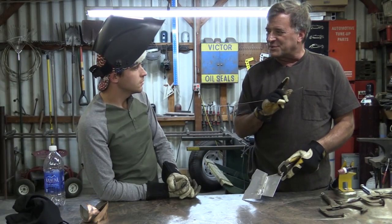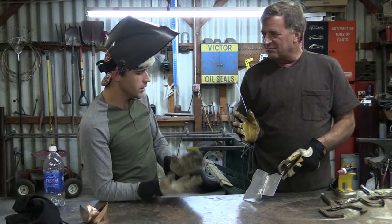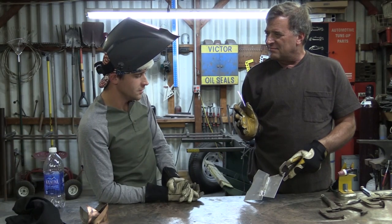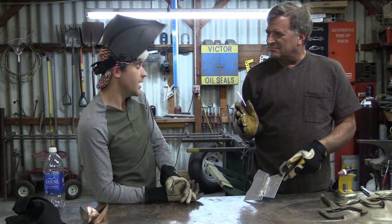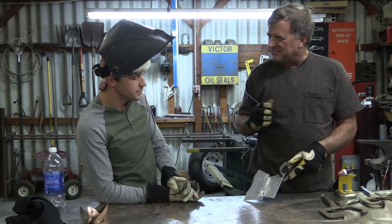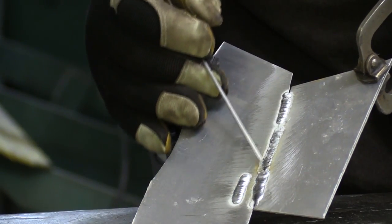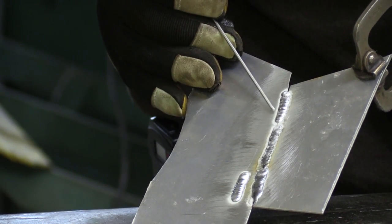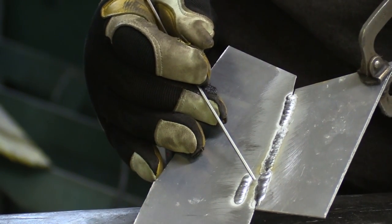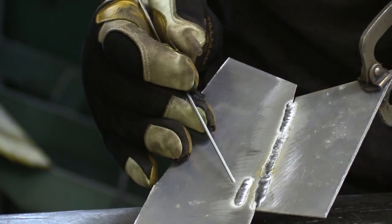So you've never used this machine before? Nope, not any of these AHP machines. How much experience do you have with TIG? About four years. And you work in a commercial setting? Yes — fabrication, different sorts of things, basically high-end fabrication for homes, restaurants, ventilation hoods, stuff like that. So this is where you ran with no pulse, then we tried the low speed pulse, then the high speed pulse at about 100 pulses a second, and then we went to 200 a second, just maxed it out to see what it would do.